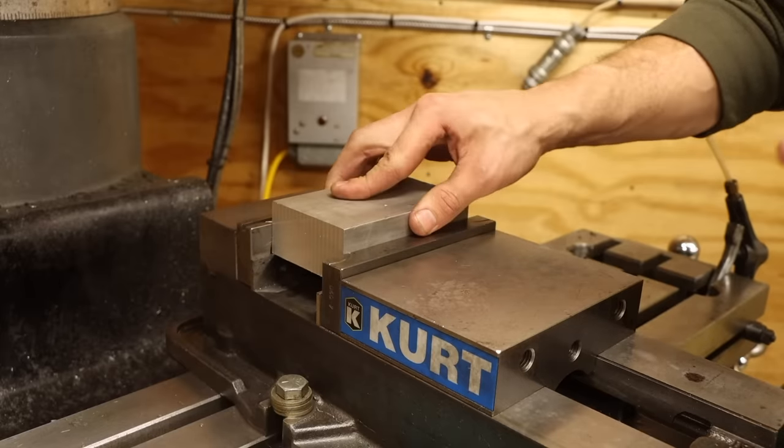I still have some spring mounting hardware to make, but with so many parts piling up it only seems right to test fit everything first. Each side of the arm links gets a nylon thrust washer that fits over the sleeve bushing, held in place with a shoulder bolt and lock nut. The elbow plate gets attached the same way, then the wrist, and lastly the camera mount to hold the ball head and the camera. This thing is absolutely massive — but I love it. Just from where it's mounted on the workbench I can reach both the mill and the lathe, and get shots way down low as well as up near the ceiling. There's already enough friction in the joints to support the camera without springs, but I feel like not including them is just asking for trouble.